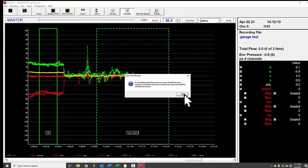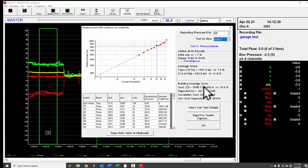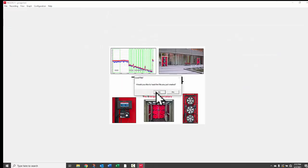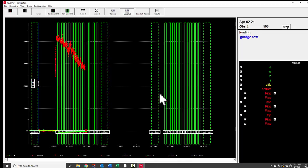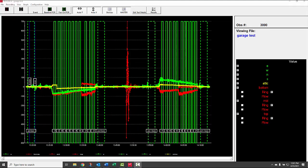The second baseline is the pretest baseline for the pressurization test. ASTM E779 and US Army Corps of Engineers require both pressurization and depressurization. After speeding through the pressurization test, before stopping the recording, check that both test one and test two numbers look acceptable. Go to Recording, Stop Recording, confirm stopping data gathering, then choose to view the existing test file.